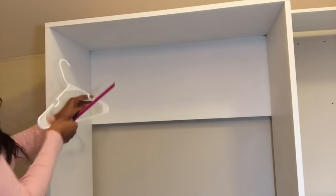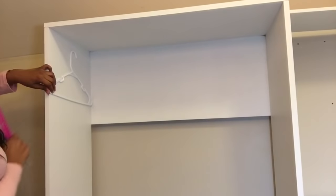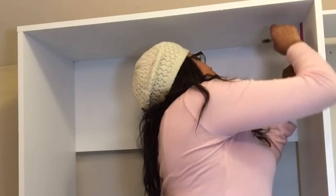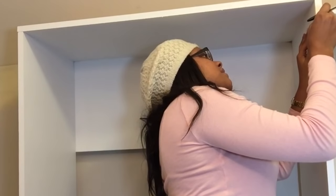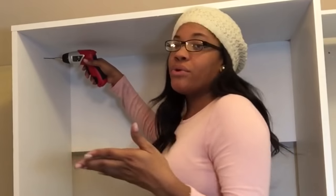I'm going to take a clothes hanger and measure exactly where I want to put my closet rod. I think I want to position my clothes right about here, so I'm just going to mark with my pen. Now I'm going to measure how far over I've gone because I want to make the same mark in the exact same spot on the other side. I'm going to come down one and three fourths inches and go over eight inches. Now I'm just going to drill my hole where I put the pen mark.